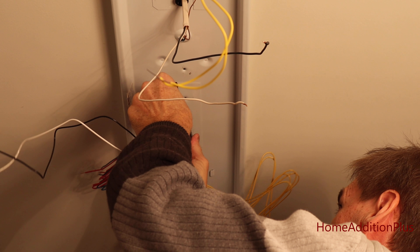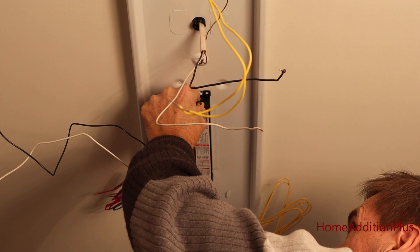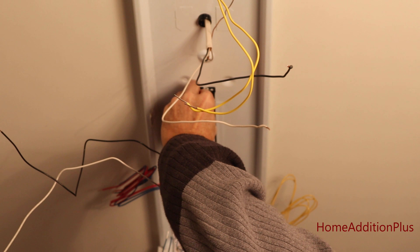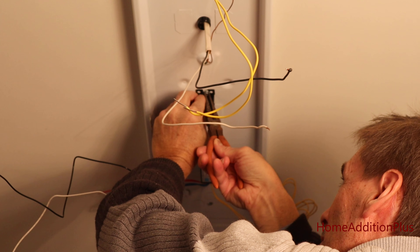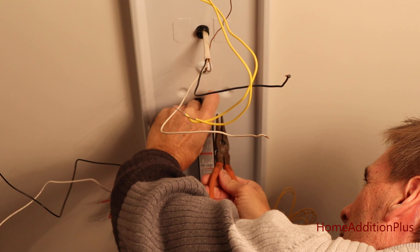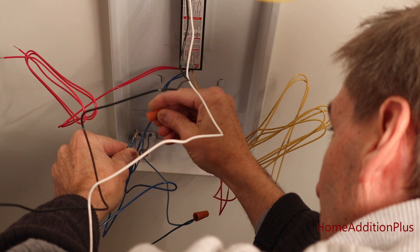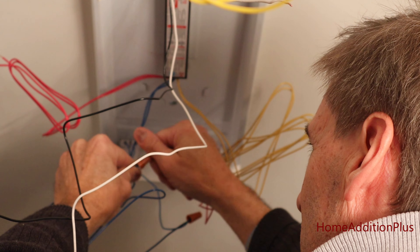To make my life easy, I'm going to mount the new ballast into the light fixture itself so that I don't have to worry about it dangling by the loose wires. I'm just putting it into the tabs and going to screw in the screw using these needle-nose pliers to hold the new ballast in place. Now all I'm doing is attaching the blue wires to the blue wires, the red wires to the red wires, yellow to yellow, black to black, white to white — putting a half-inch twist on the wires and then putting the wire nuts on and screwing them down tight.